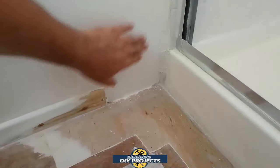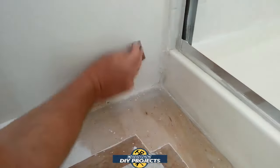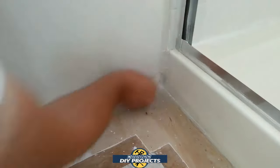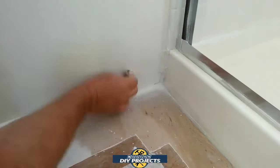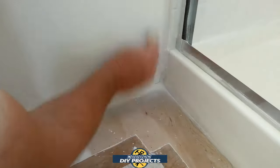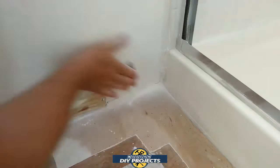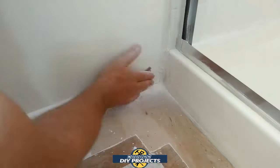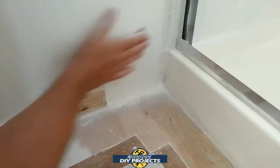I applied several different layers of joint compound, built it all up bit by bit. Now we're going to sand it all nice and smooth. You have to look and feel and get a sense for making sure the wall has been evened out so you don't see a big bulge or a big transition. You have to build out the joint compound about two to three inches into the existing wall area and then feather it all out so nobody can see what took place there — you definitely don't want a big jump between one area and the other.